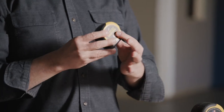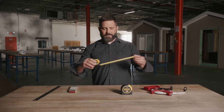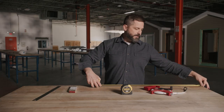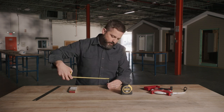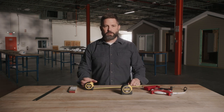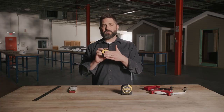There are a few different parts to the tape measure. The first is the housing or the case — the plastic that surrounds all the components that make it operate. There's the case length; my preferred is the 16-footer. There's the spring, which works like a constant force balancer — when you let go, the spring recoils the tape and it spools inside. There's also the hook or rivet at the end, which allows you to take a measurement by hooking it onto an edge, and it also has a hook slot so you can hook onto a nail and make your measurement. There's a thumb block which lets you lock the tape when you need two hands. And lastly, there's a belt clip, which is removable — you can put it on your belt or take it off and put it inside your tool belt.